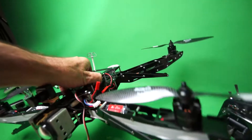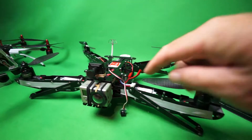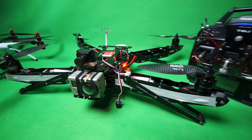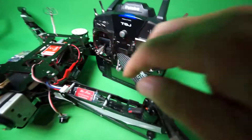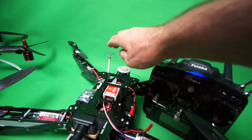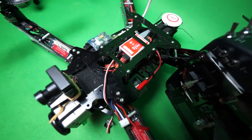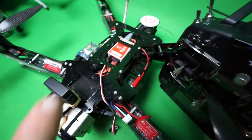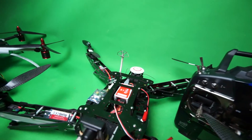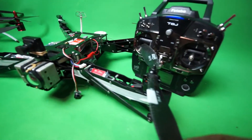It sits there nicely, and I get about 12 to 14 minute flight time. I've got a little GoPro 2 on the front there, and my little flight camera there. In the arms I've got 30 amp speed controllers. I've got a little Video TX there, and just in here I've got a little 3S LiPo battery that drives the flight camera and the Video TX, as I'm using a 4S battery — so too much power. I've got some carbon fibre props.